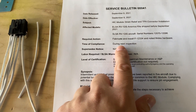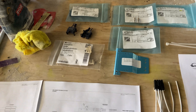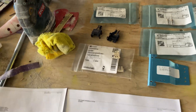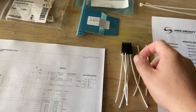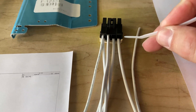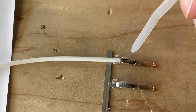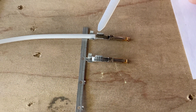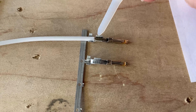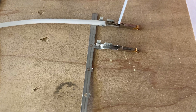Right now they list this as during next inspection, but to be honest I would just ground the airplane and do it as soon as possible. I'm going to go through how to make a pin and insert a pin into this connector. I need the connector itself too. I have two more wires to put into this connector. I've taken one of my lengths of 14-gauge wire and stripped off the end. You want to strip off just enough so that it passes past this prong here but doesn't really extend any further than that.